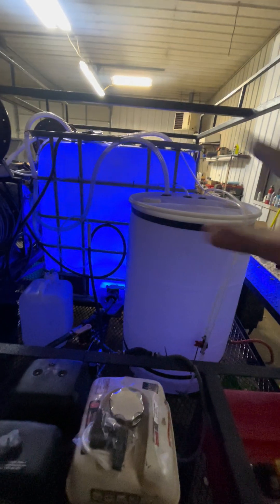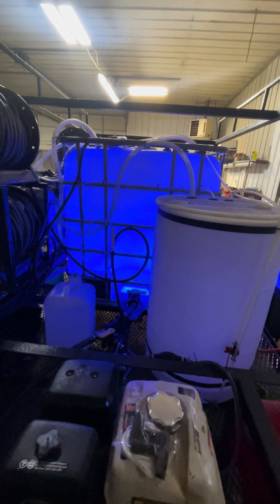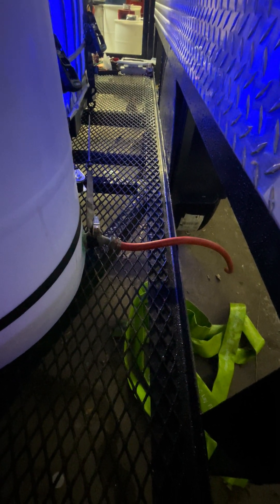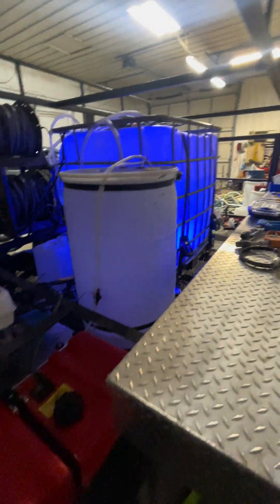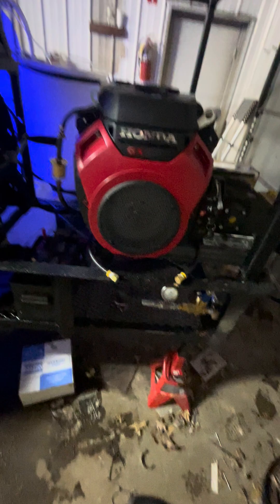Other than that, everything is kind of ran a little crazy and wonky. I hopefully plan on cleaning that up a little bit so it's not so weird and wavy looking, but for the most part it works — it's efficient. I also have a valve installed on my SH tank, so if I need to pull chemical to fill up any pump sprayers or anything like that, I have that hose that will drain the chemicals. That is basically how I have my trailer plumbed up. Let me know what you guys think, if you think I'm going to be running into any issues. Everything has been pretty much tested — we ran the eight-gallon-a-minute today and did some surface cleaning on the other side of the shop.